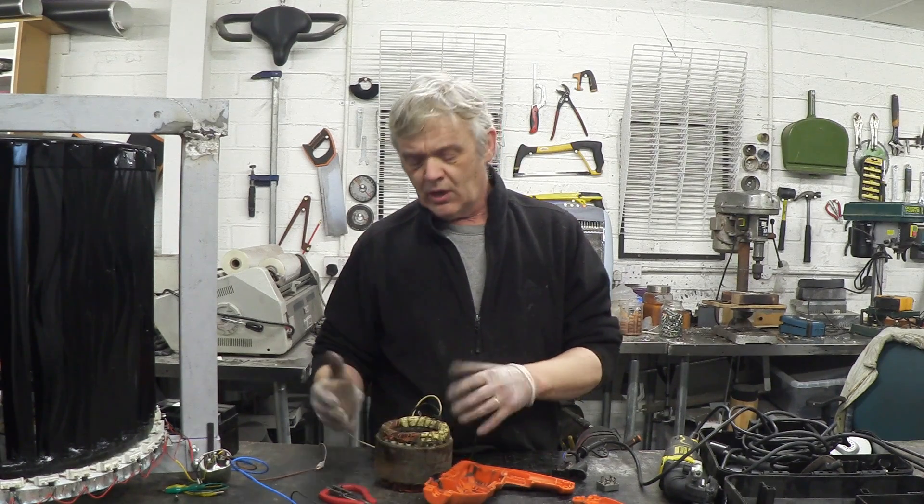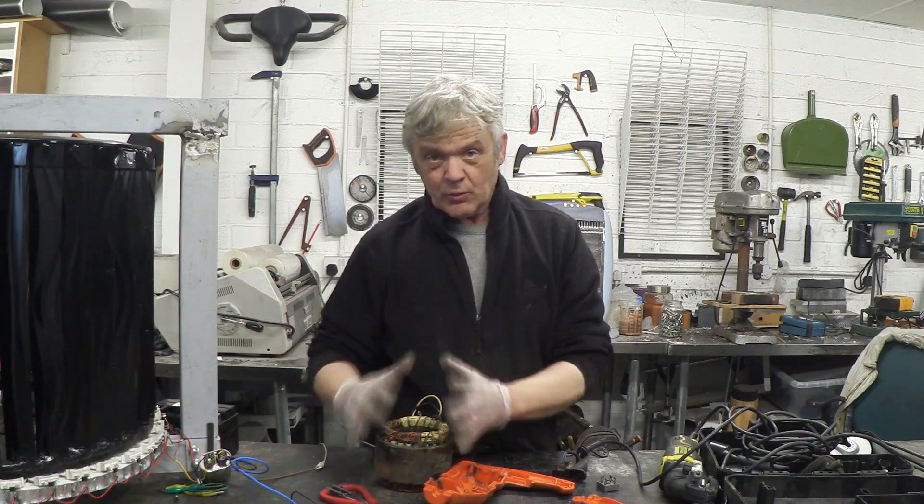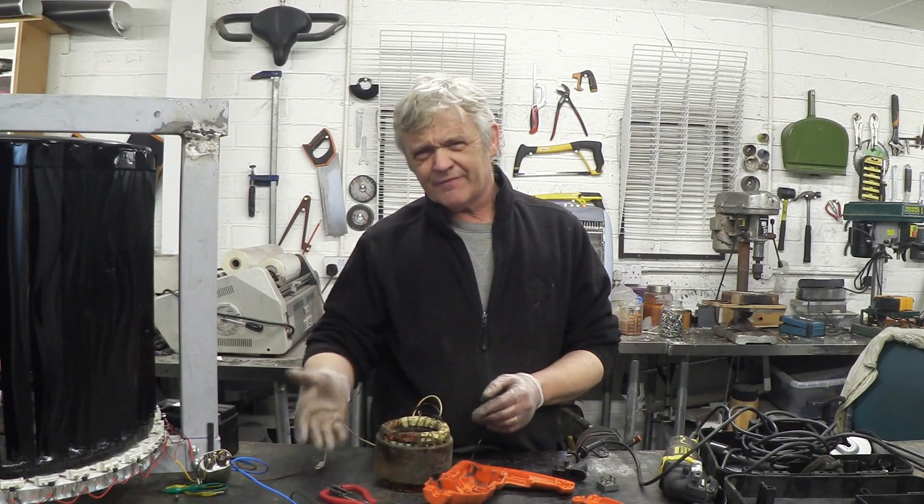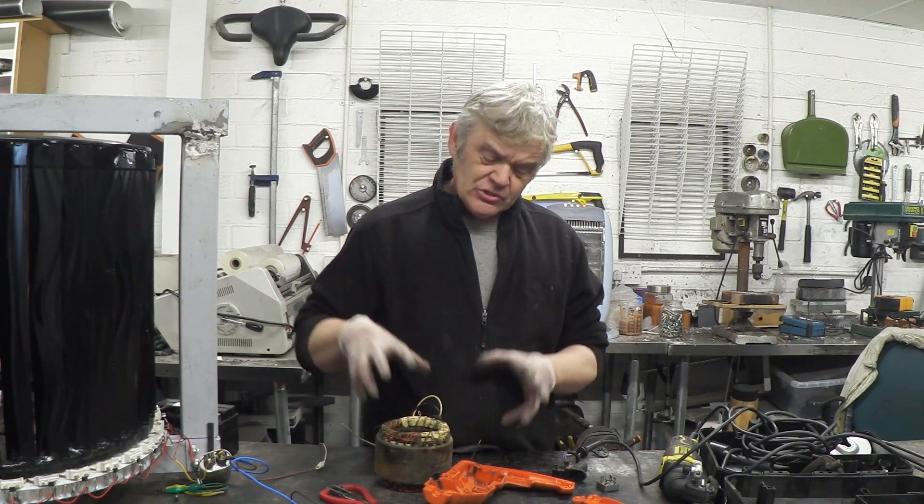To create a magnetic field in there is going to be relatively easy and we could use it as a magnetizer - I'm going to use it for something else, but we could use it as a magnetizer stroke demagnetizer. The only thing I really need to do is plug that into the mains and supply it with 240 volts. It'll draw about 4 amps or so, and we need some way of rectifying that and turning it off and on.